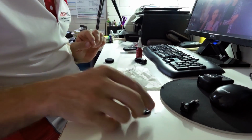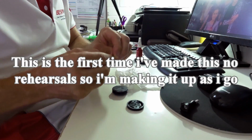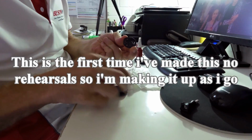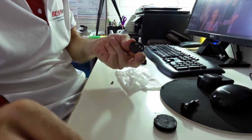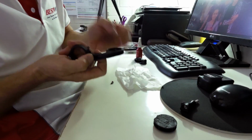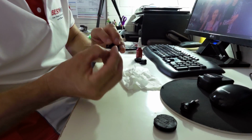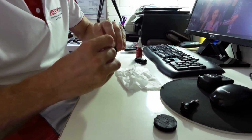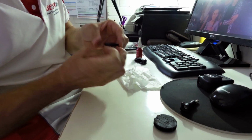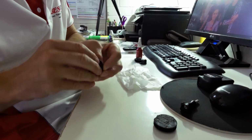Okay, so you now know how to grind these down, and also the little screws, okay? Now these screws are tapered, okay? They've got a tapered head because of this other insert that eventually this one is gonna lock into, which is gonna sit on the underside of your Garmin mount, right? So basically you're gonna have two of these, one there, that's the one we're gonna insert there, okay? Now they're tapered because there's a tapered little cup in there as well, okay? And they sit inside there like so, okay? If they're not tapered, they'll stick up and you won't get your camera mount to lock in.